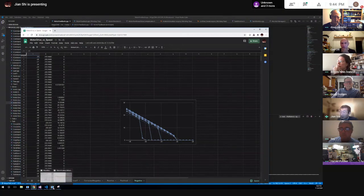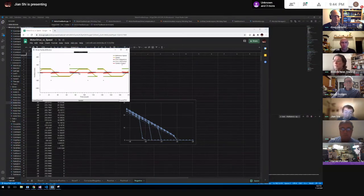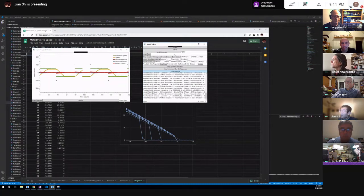By the way, I have this compensation in there that linearized it and got rid of the dead zone, and I can kick it off by starting with a higher drive. So now it is doing okay. We can try. I like this interface here. For the position, the P gain is the old I gain, and the D gain is the old P gain. So if I put a higher gain,